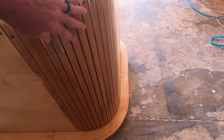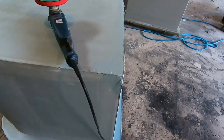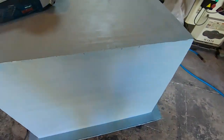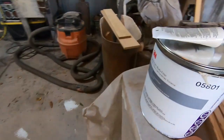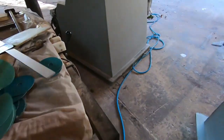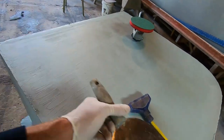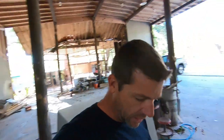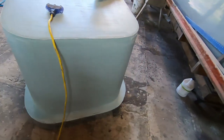We're going to come back in and fill all these grooves with a nice body filler, fill all the screw heads, and get ready to put fiberglass on this thing. We've got the fiberglass work all done and this thing is now coated with two coats of polyester body filler — basically a creamy paste with a hardener mixed in, spread out with a putty blade. As I was telling my son yesterday, it's kind of like frosting a giant cake. It took nearly all day long to get this thing fully coated.